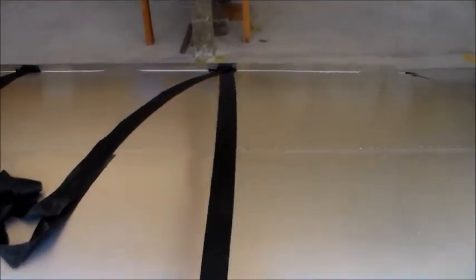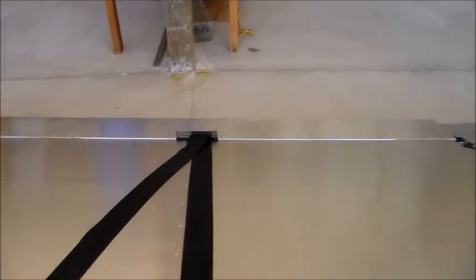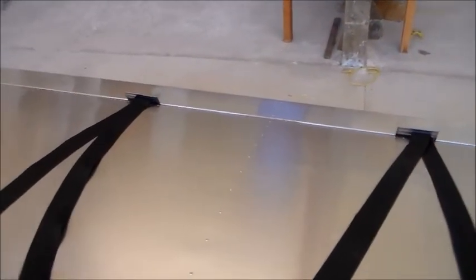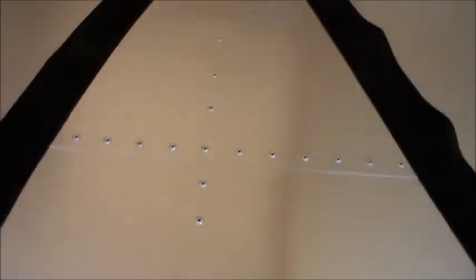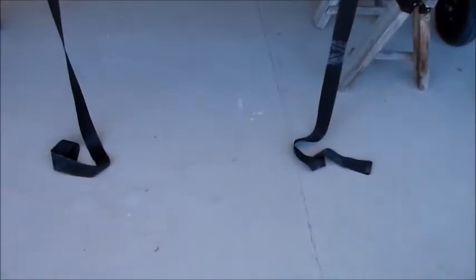I've got the webbing secured at the aft end in the aileron slots with those metal brackets, and then I've stretched the webbing to lay along a rib line — if you look carefully here there's a rib line — so that when I lift on these straps they'll lift on the strongest part, which is the rib lines. Then I'll throw those ends of the straps under the wing and connect them to the underside of those brackets so that I've got it completely entrapped.